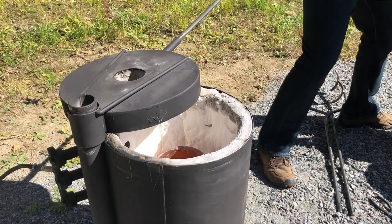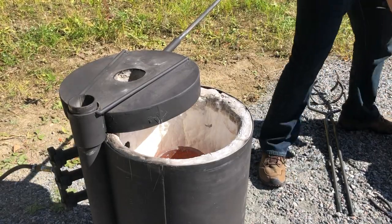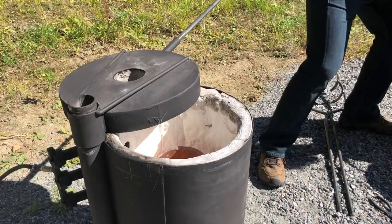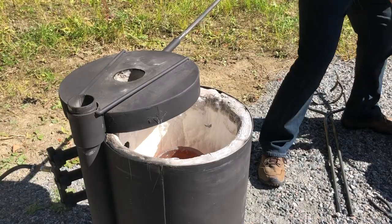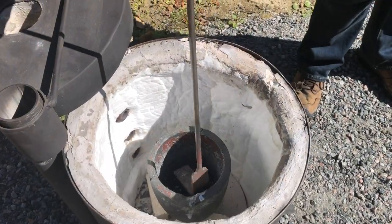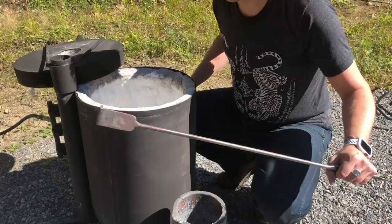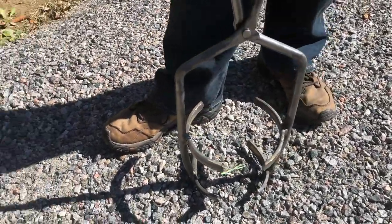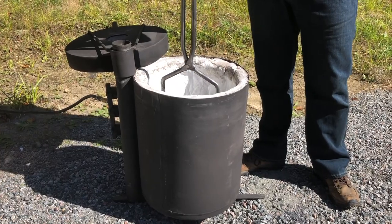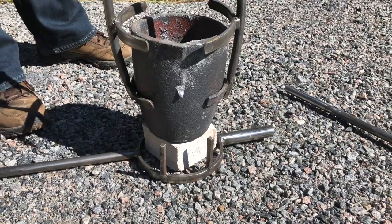The reason I built this for myself was mostly so I could be doing bronze small sculpture. The melting temperature of bronze is about 2100 degrees Fahrenheit, and I know for a fact this will easily get up to 2000, so we're not too far off. Along with the foundry, I built some custom tools: a little rake for scraping the oxide off the surface of the metal, a special pair of tongs to reach into the hot foundry and lift the crucible out, and a holder that also acts as a pouring mechanism.